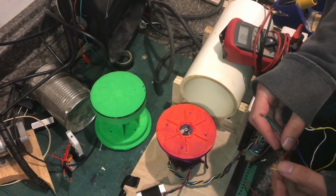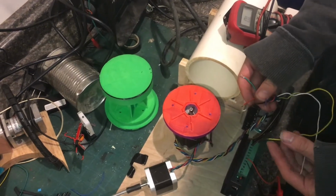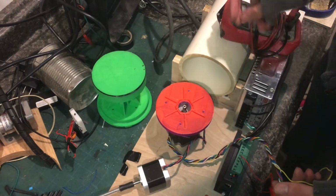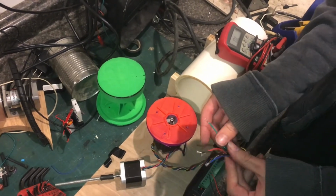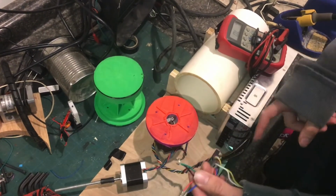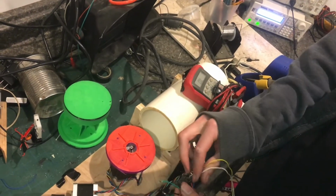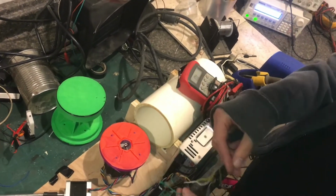And that's because when the resistance is half, then at the same voltage, twice as much current can flow. So the motor will behave a little bit differently. So what I can do in the next part of the video is wire it up like normal, where they're in their pairs, and we'll use a function generator to start slow, ramp up until the motor stalls. And then we will switch over to using just half the coils, using the center taps, and we'll do the same thing, and we'll see what happens.